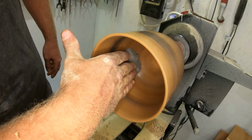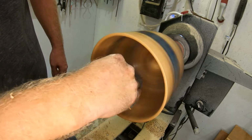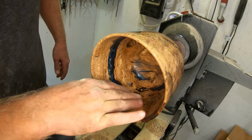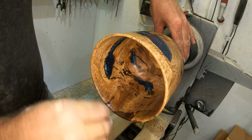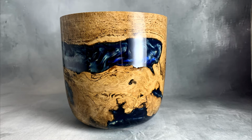With the Alumilite, you still will have to apply the Mylands. If you have any kind of heavy spots, any kind of runs or whatever, just from wiping it off, use the steel wool to get it all nice and smooth for you. That way, whatever finish you apply to it, like that wood bowl finish, you don't have any kind of imperfections on the surface. I didn't record that part, but I will post a link up top for how to apply the wood bowl finish, or how I do it.